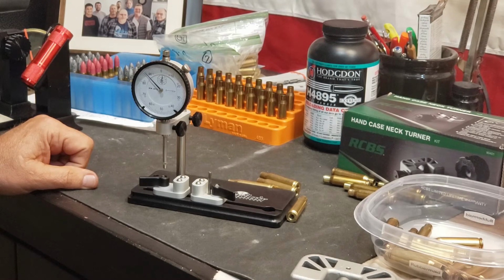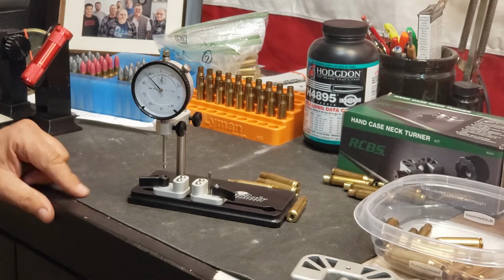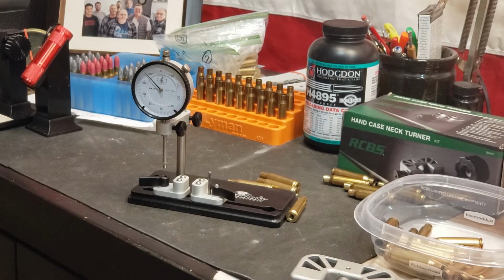I'm doing some stuff with my Borescope, and I'm going to clean. Oh, I ran the Borescope down my 308. It hadn't been cleaned, and I noticed an abnormality in the bore, and I'm going to clean it and take a look again, see if I can see any more abnormalities in it. I was basically getting a place at about 2 o'clock on the barrel that I did not have any lead or any copper or carbon fouling through that one section right towards the muzzle. And I'm going to clean it and see if I can see anything else.